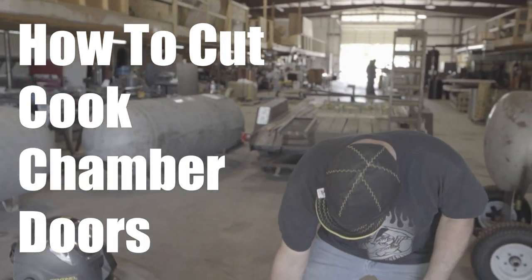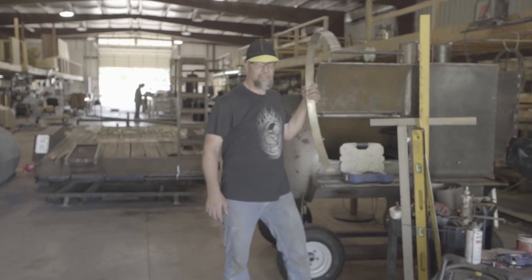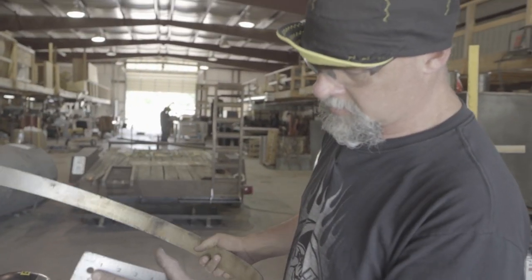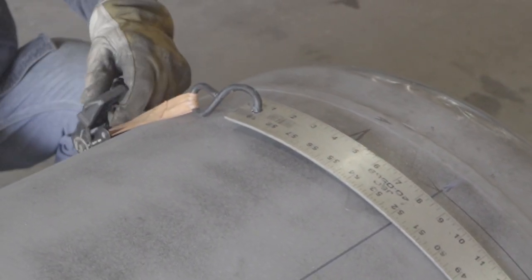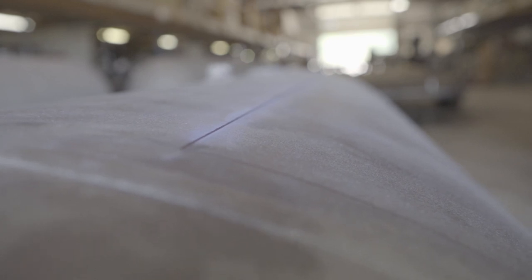So we're getting ready to cut and stuff. What I do on this is I use a straight edge and a plasma cutter — this is my favorite way to cut these. I got a special straight edge right here. I got a hole drilled in each end, and then I got a ratchet strap that holds this thing tight to the cooker. I get my line measured up here, and when I cut that vertical run, I have a drag tip on my plasma cutter that'll just ride right against that.